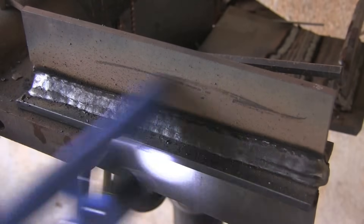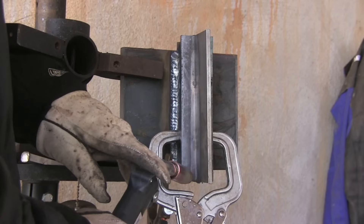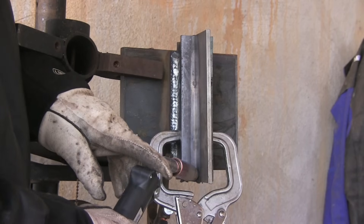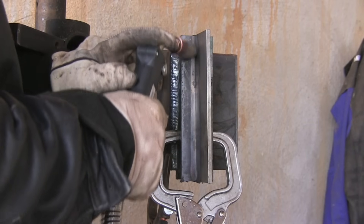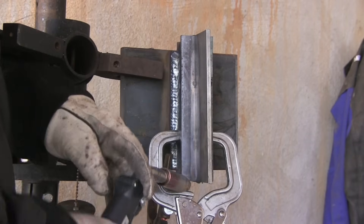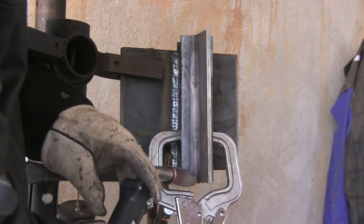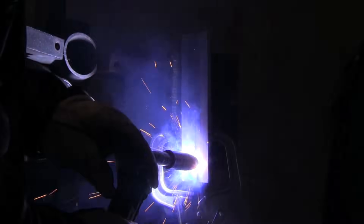Alright, let's go uphill now. This is the same T-joint — quarter inch thickness, roughly six millimeters thick. What you want to do is maintain the same gun angle all the way up the joint. What you don't want to do is let it cock upward as you go up. If you get off a little bit it's okay, but if you shoot for 90 degrees — dead nuts at 90 degrees — you'll probably wind up with a slight push angle and you'll still be okay.